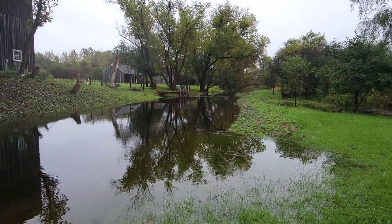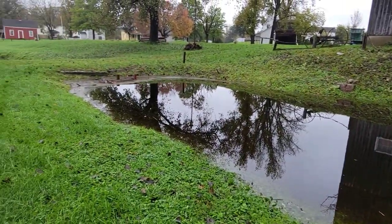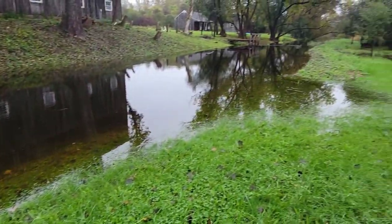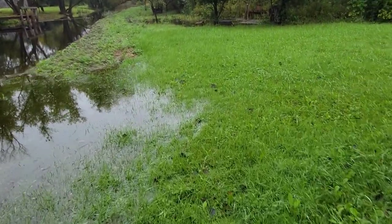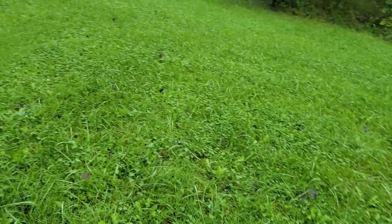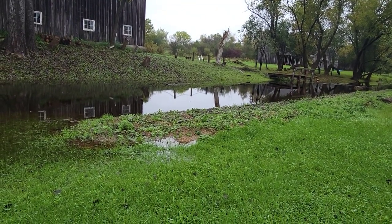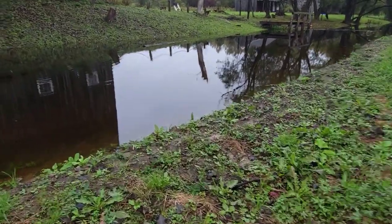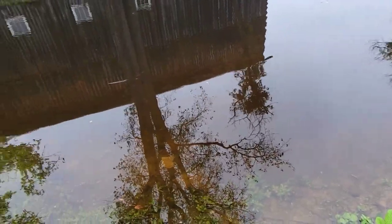After I had cleared this out, with the spring rain this had filled up a few times. I put a little coffer dam in front of the culvert and the water would back up, go past the line — the towpath — and be well into here if not further. That would all be completely submerged because none of that towpath berm was there. I dug it out and started building it. The more I started going, the more everything just kind of made sense or told you what to do.